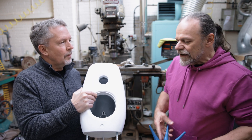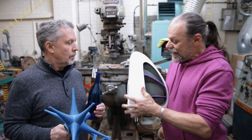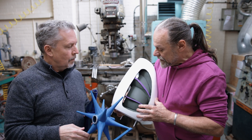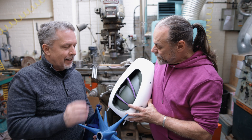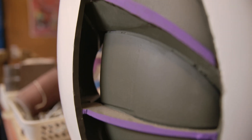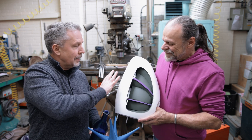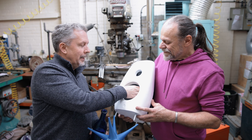The first stage was to fold these back in on themselves, still having the 12-sided dodecahedron approach. But it became reasonably obvious that in a practical loudspeaker all we had to do was arrange those horns around the periphery. If you see in the cutaway of the speaker, you've got an outer shell obviously, but you've also got this inner shell, and the absorb material is stuffed into these channels. Effectively you have a ring — it's like a cabinet within a cabinet — with the tubes inside it. A hidden benefit is the structure is rather ideal: two skins separated by ribs, so not only does it absorb resonances but it makes the cabinet much stiffer.